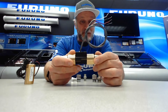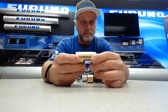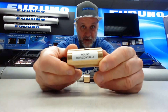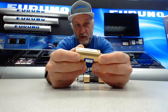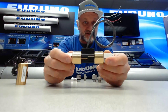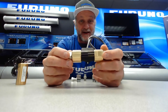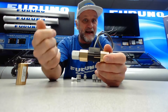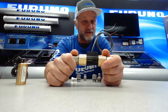You may be familiar with a competitor who has a similar helm flow switch, but it's limited — you have to mount it perfectly horizontally, and if you mount it vertically or off a little bit, it just doesn't work right. With SafeHelm 2, we've gone beyond that. It's not position sensitive, so you can mount it vertically or on an angle without worrying about false triggering. There are sensitivity adjustments in the software of the NavPilot 300, 700, and 711C so you can adjust when the system triggers SafeHelm or FPS.